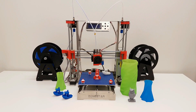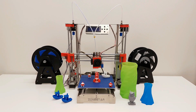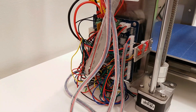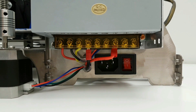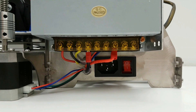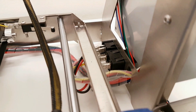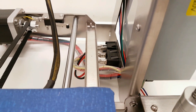Before my final words, I'd like to share some things I didn't like about this printer. Starting with nozzle level: my left nozzle was around 0.1mm higher from the print surface, so I had to screw down the right nozzle just a tiny bit to make them match. Next, wiring is a bit messy and I recommend printing some kind of cover for the motherboard. The power supply is the open type and the switch is positioned on the main AC cable, so I definitely recommend printing some kind of PSU cover — there are plenty of options on Thingiverse. Last but most important: the AC terminals on the back of the switch are very close to the metal frame. Not a smart move, so I definitely recommend putting some extra insulation there for extra safety.